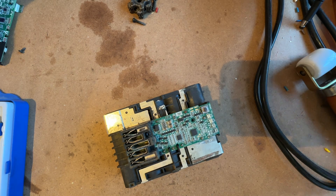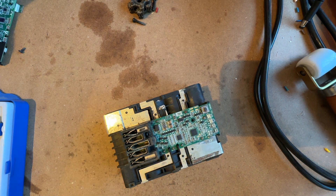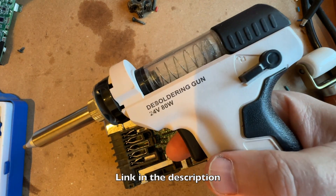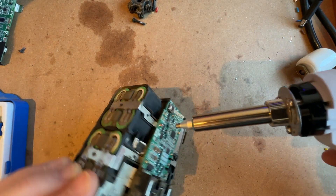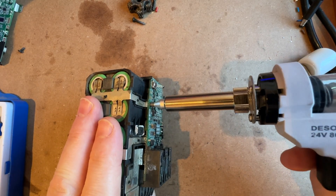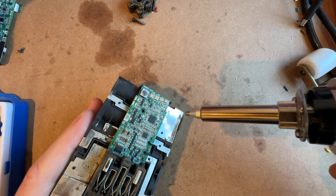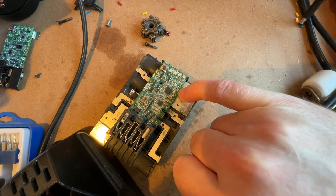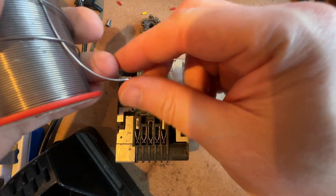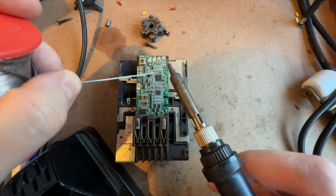What I'm going to be using — you could use a standard soldering iron with solder wick, but if you're using solder wick use a bit of flux as well, or one of those terrible plunger pen things. I've got a magic moving solder gun — this end heats up and actually sucks air through the end. The problem with lead-free solder is it's got a much higher melting point, so if you have any problems with lead-free solder melting, what you can do is add a bit of leaded solder and that will reduce the melting point to make it easier to remove.